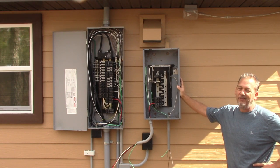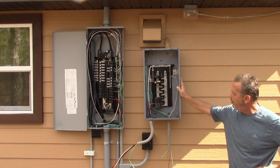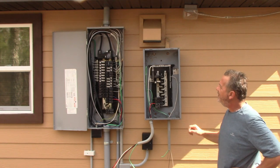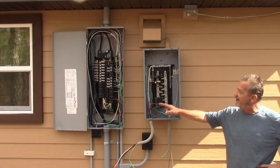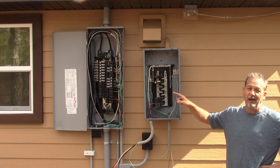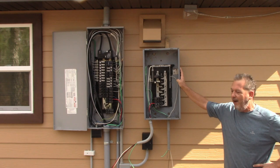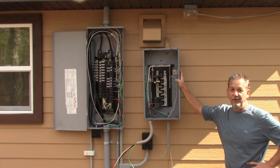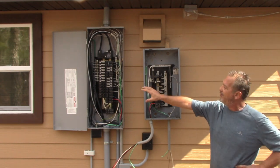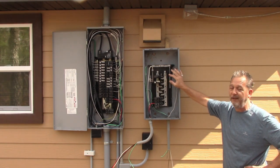I'm not going to hook this up to my panel — I don't want to put more knockouts in on the bottom. What a transfer panel basically does — and the reason you may need one — is that in certain areas, what I showed before will power everything in your house, but you have to turn certain breakers off. You can't run your entire house off a 30-amp generator powering a 200-amp panel. Some areas, for permitting, require load calculations, which means you take the circuits you want to run on the generator out of the main panel and move them into a transfer panel.